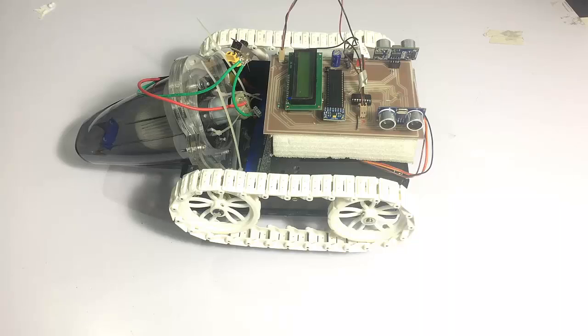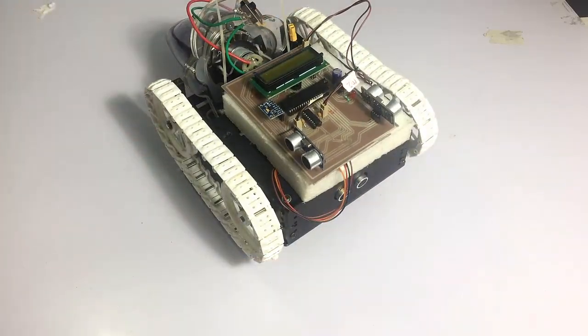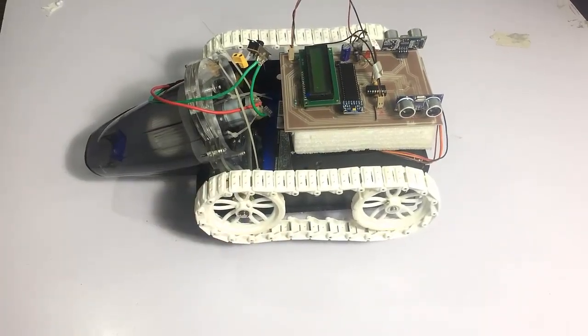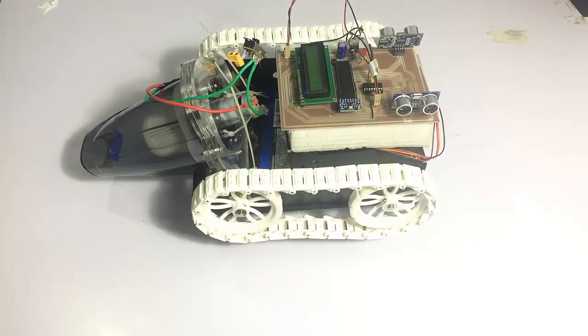As you can see, we have a microcontroller-based circuit here. The circuit has ultrasonic sensors — two sensors on the sides and one at the front. This is powered by a battery placed inside. The LCD is used to display the timing of how much time the cleaning was completed, and we also have an accelerometer which is used to check the turning angle, so that the system turns with the best available accuracy achievable on this project.